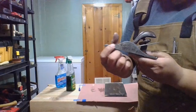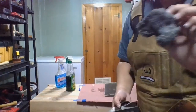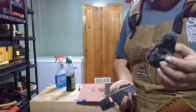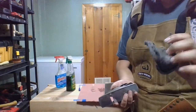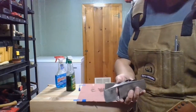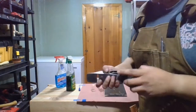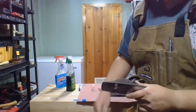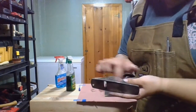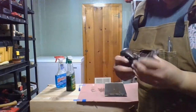If I really wanted to work on the sides and get this all nice and polished up, I'd just get some really fine steel wool - maybe triple zero or even quadruple zero - and just kinda polish it a little bit, especially hitting it with some Simple Green and then paste wax to get it all nice and shiny. But for the purposes of this, I don't really feel the need to go too ham on it. It is just a little shelf queen for me, just to say I have a little Ohio plane.